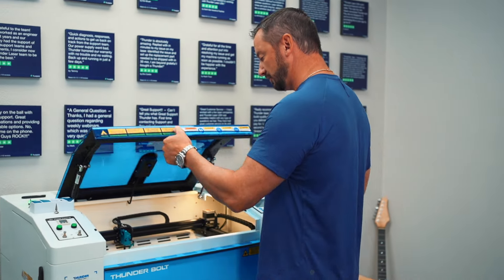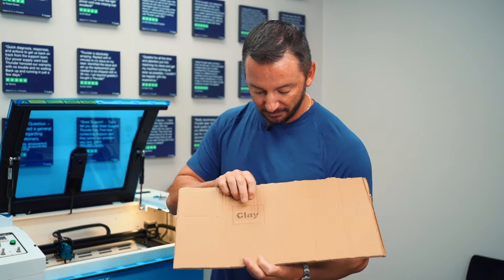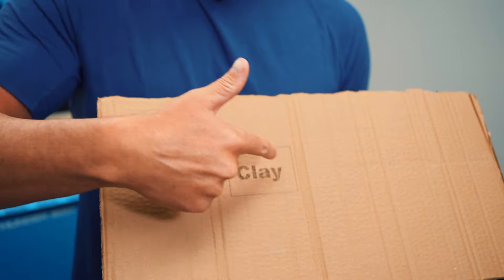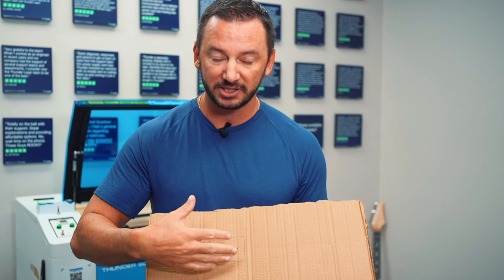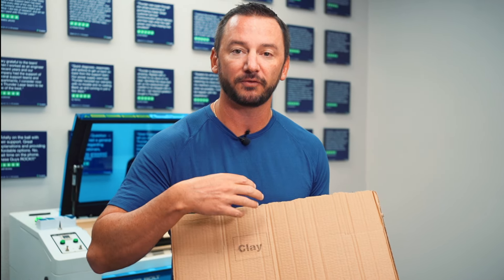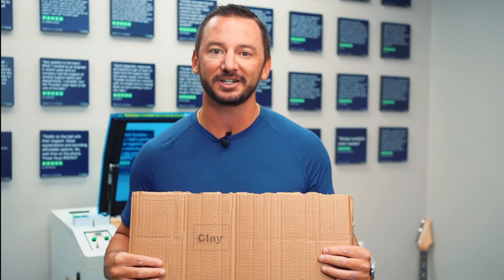Now that it's done, I'm just gonna come over here to the machine and pull my material out. We didn't quite get through — you can see the line here where it tried to cut it out, but it didn't quite make it. That means I either need to increase my power or decrease my speed to get through. So if I was doing this in real life, I would go try it again and find a better setting for cutting cardboard. That was a simple way to do a nice easy project on a free piece of material. My goal is just to get you guys working on stuff. When you're learning, keep repeating, doing reps. We'll dive into a more complex project next. See you soon.